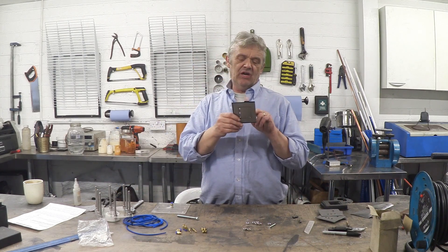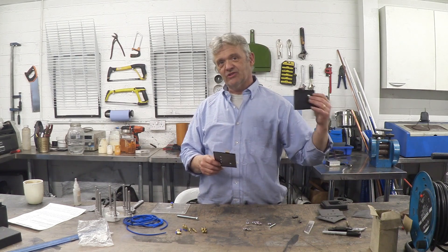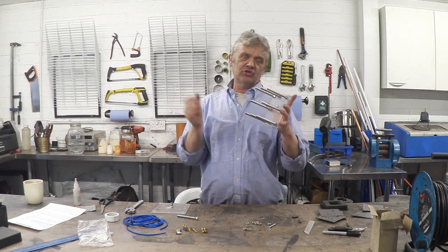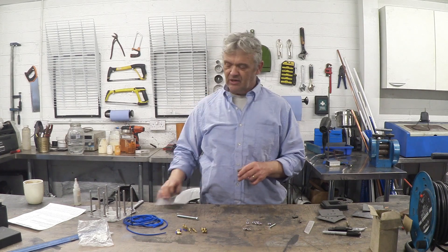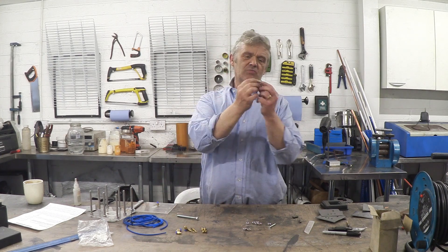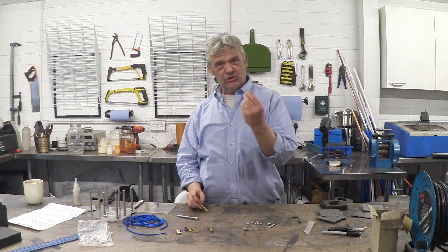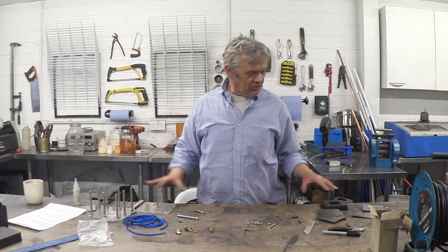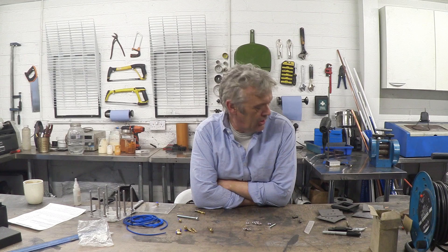The midpoint plate has an electrolyte hole and gas holes; the end plates only have an electrolyte hole on one and a gas hole on the other. I laid them up in a dry cell configuration — I cut a couple of acrylic plates, put bolts in, with gas out on one side and electrolyte in on the other. I used little gas nipples bought online: a drill-and-thread approach, screwed them in with a bit of super glue — again about 20 minutes. The longest part was cutting the neoprene gaskets; the rest was a breeze with scissors and a carpet knife.